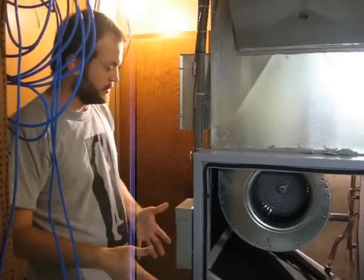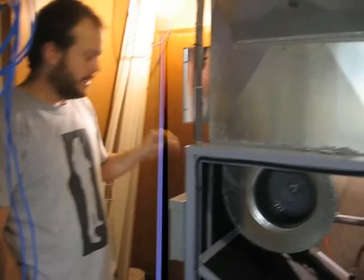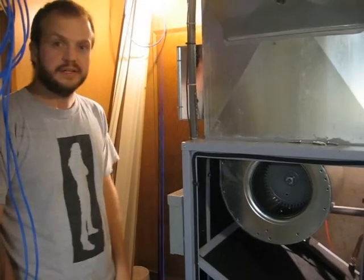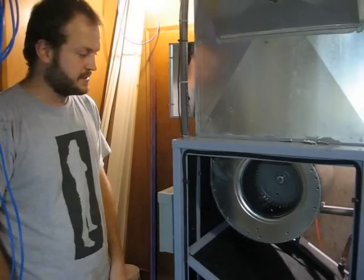The total amount of refrigerant used is about 6 kilograms. The amount of power that the compressor and the blower take is about 10 kilowatts. And around here, the net cost of electricity is 10 cents a kilowatt hour.